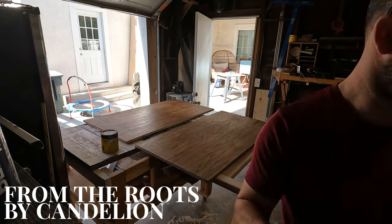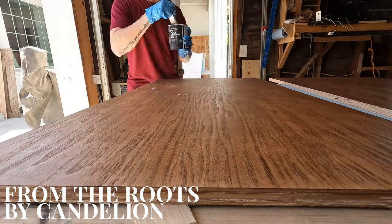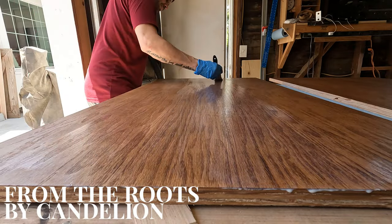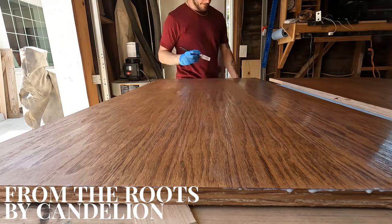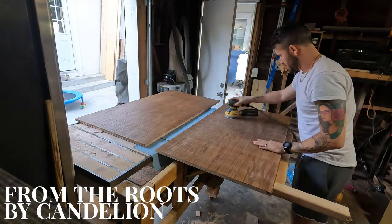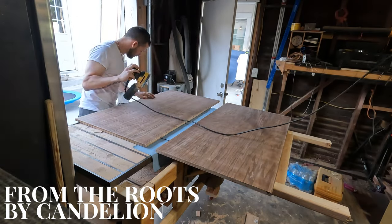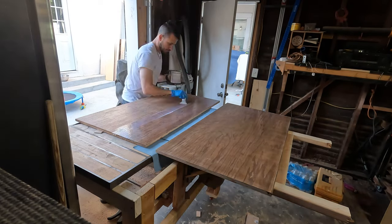I got the third piece on the back side of the shop done, and now I'm sealing it with a matte finish. I'll do two coats, sanding lightly in between — I think at 320 grit. Just a very light sanding, hardly any pressure, but it does kick up a lot. Off camera I'll wipe it down and then apply the final coat.